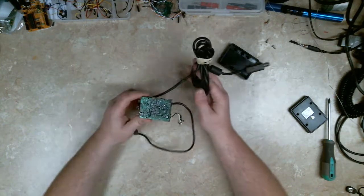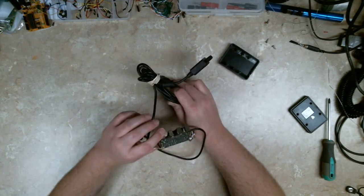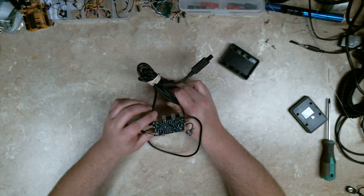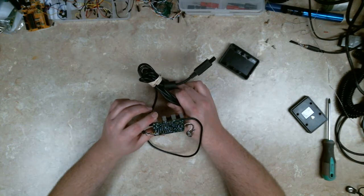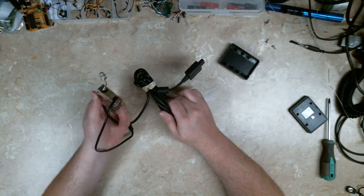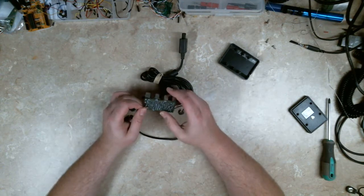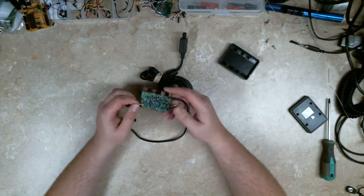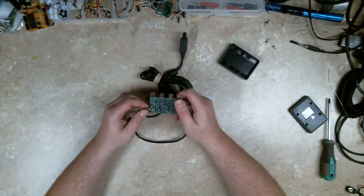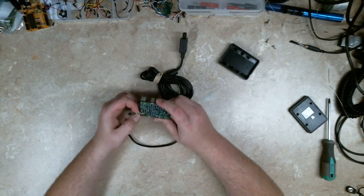This circuit works by taking the NTSC composite signal here off of this. Actually, it looks like it might even be S video. I see two video lines and one audio. Either that or it's stereo. Can't be stereo. Oh well. Surely it's not stereo. Anyway, the video portion of this thing works by taking that baseband composite signal and mixing it with a RF oscillator.